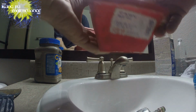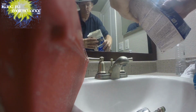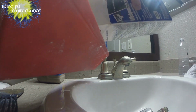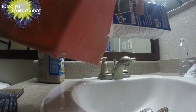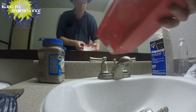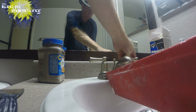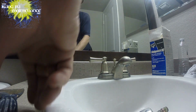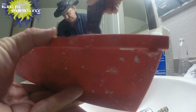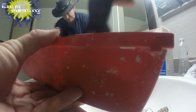And if there's a concern about mold or whatnot, well, you're sealing your wall first so that the cardboard is not exposed, and so you're making it water resistant, and then you're adding your patch. And really, when you're mixing up mud, you're mixing it with water anyway, so there's a little bit of moisture. And so by using a wet rag on the wall once your mud dries, it's not really much different than adding a wet mud patch. It's kind of the same thing. So that's why I like to use the wet rag.